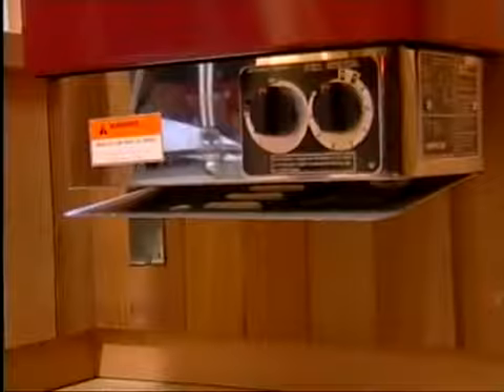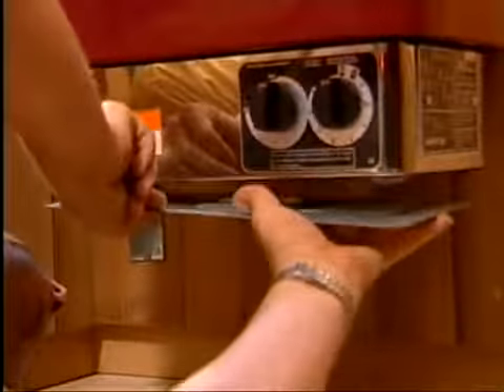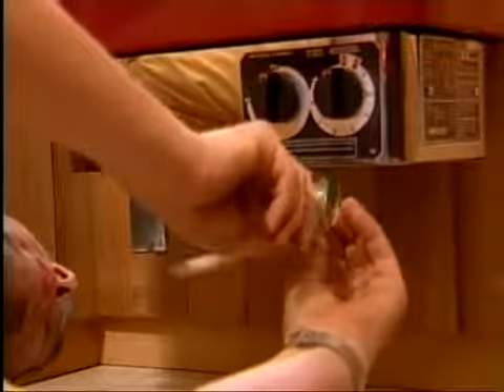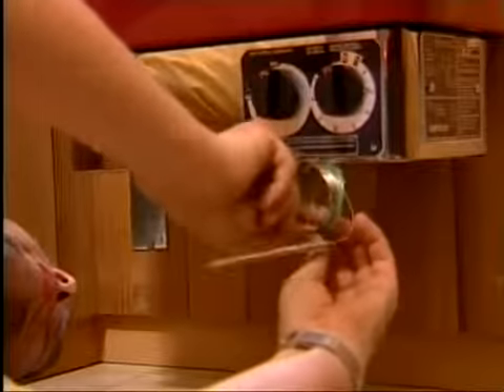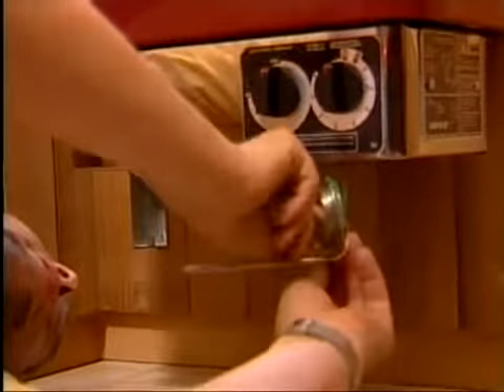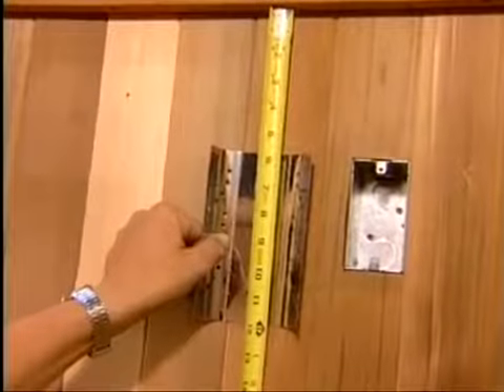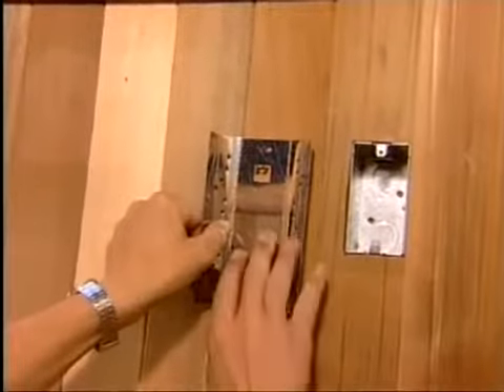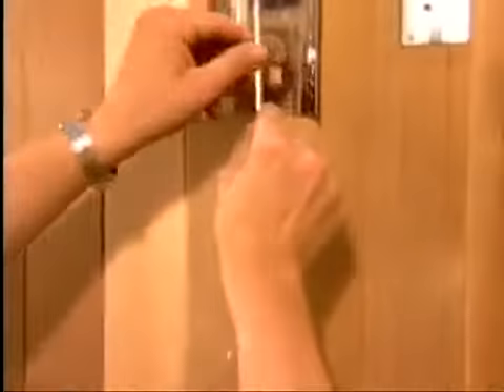Screw in the bottom two screws to secure the heater. If the controls are mounted on the heater, there is a thermostat bulb and wire located inside the metal cover on the bottom of the heater. This is a job for your electrician. However, you should note the location of the thermostatic bulb and its placement to your electrician. If possible, the bulb should be installed a minimum of 12 inches from the side of the heater, and the bottom of the bulb cover should be a minimum of 12 inches from the ceiling.